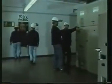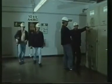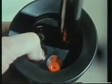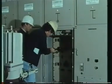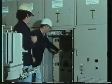Rule three: verify that the installation is dead. Here too, a functional check with a voltage detector is required. And a functional check on the bus bar as an additional check for especially cautious and doubtful electricians. Now follows the voltage test on the cable terminals.